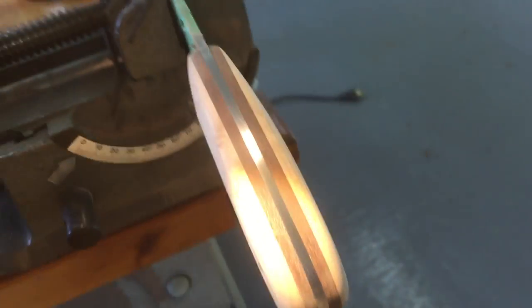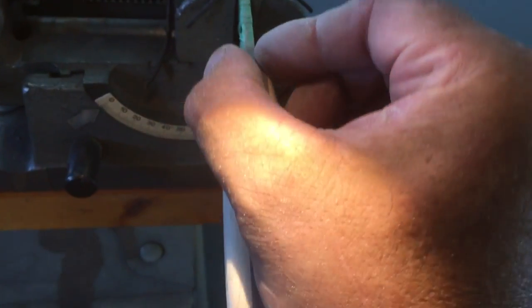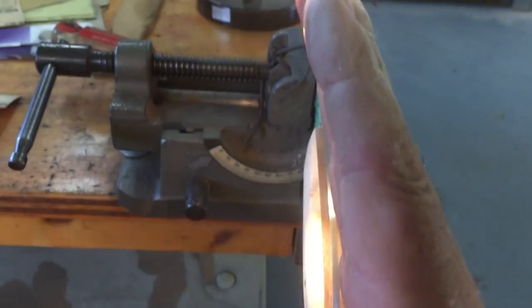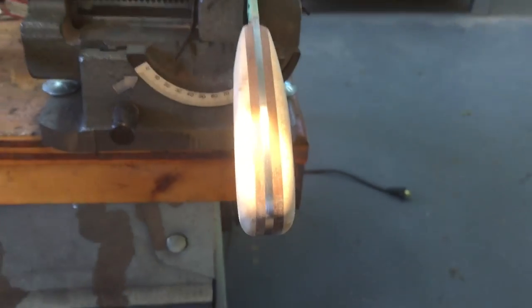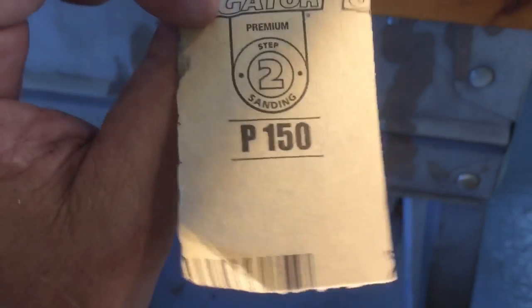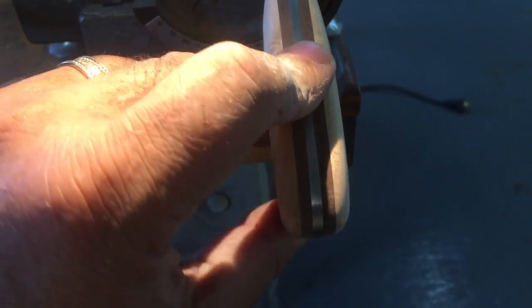The way I do these handles is I do the top left and right edges, then I lift my vise up and work on this side, then I turn the knife over and work on that side, then I turn it upside down and work on the bottom. That's with 150 grit — that's what I do my cleanup and fine-tuning with. Then I go to 220 and sand all the 150 marks out, then 400 and all the way up to 1000.